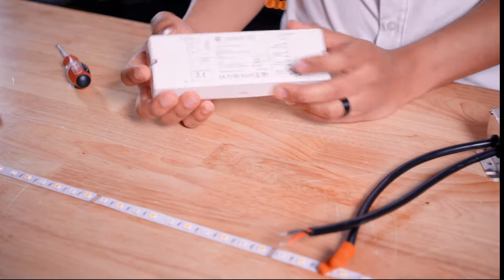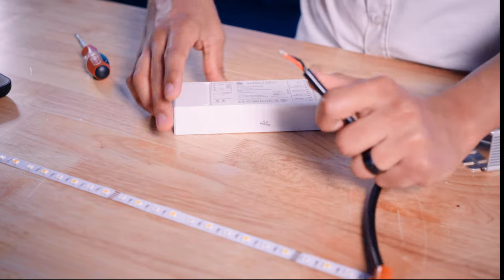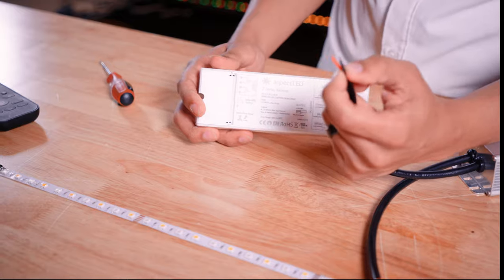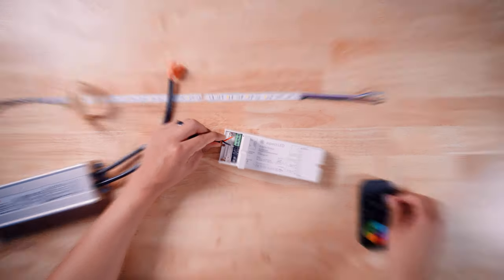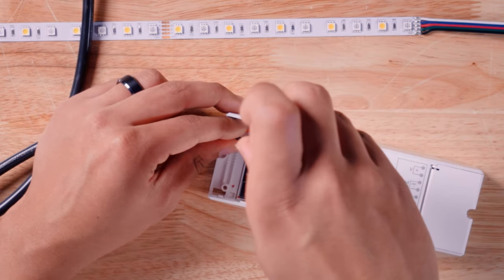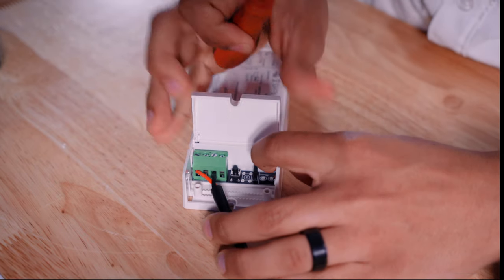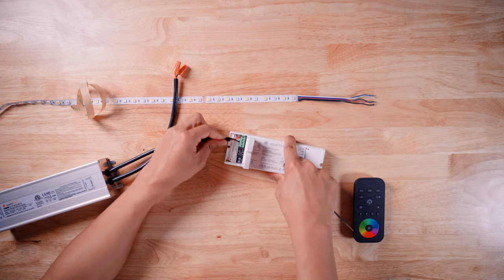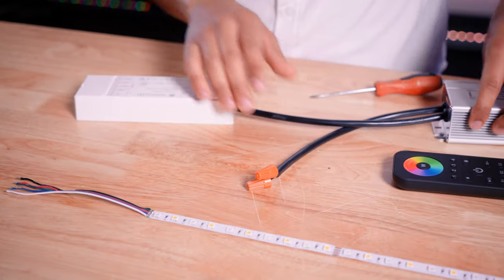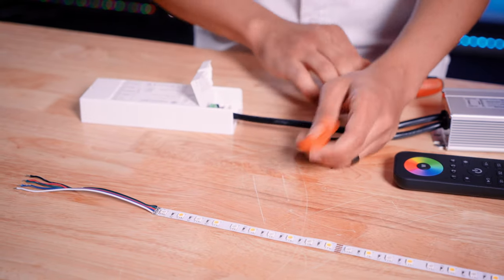The next thing we're going to do is get our Z-Series receiver and our power supply and wire these together, because the power is going to feed the receiver, which is going to feed the strip lights. There are two wires here that go with the two leads — the red wire lead goes to the V positive and the black one goes to the V negative lead. So we're going to go ahead and install the red where it goes and the black where it goes. The red goes to V positive, and we're going to screw that in with our flathead screwdriver. The black goes in just like this, and we screw that in and tug it. Some power supplies come with two leads — we just wired one lead into the receiver. Some come with two leads to expand the LED system; just cap the other one off and put it to the side.